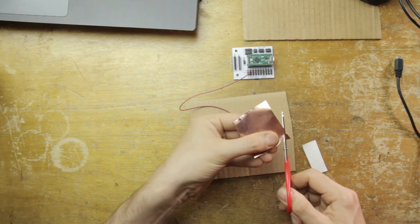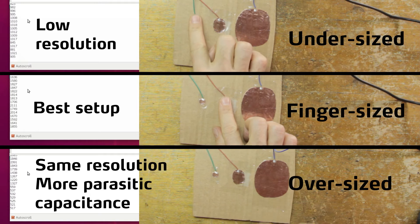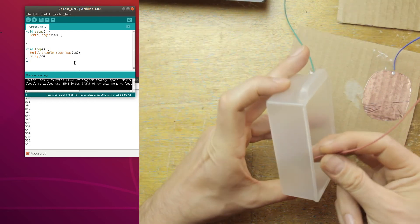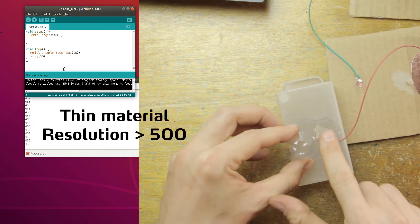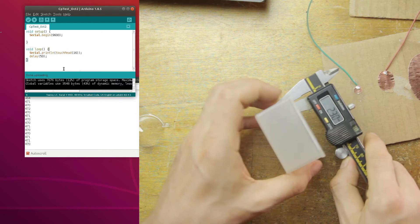There are two sides to overcoming this problem. First, we try to make sure the endpoint of the sensor has such a strong and clean signal that all of the parasitic capacitance read by the rest of the system can be dealt with as just a small bias and some manageable noise. Making the sensor's surface area bigger can help, but only up to a point — if you make it much larger than the finger pressing on it, you're just adding more parasitic capacitance. Having a thin dielectric layer always helps because it makes the same equivalent sensor area much more reactive to actual touch. Thin plastic of 0.5mm thickness or less — like what you find in many food containers — works fine, as does most adhesive tape.